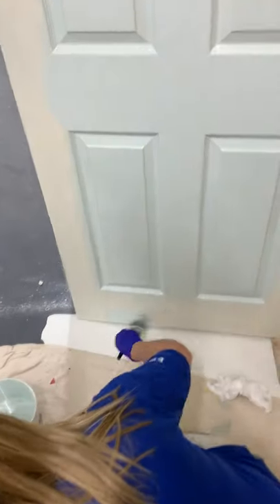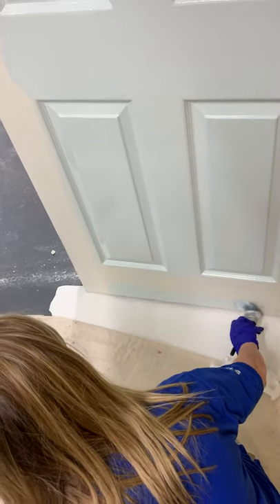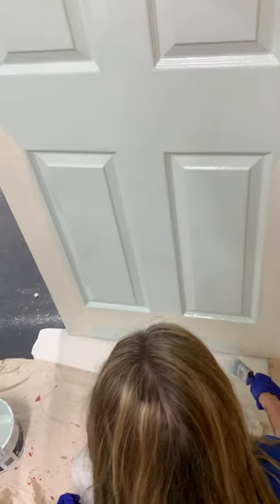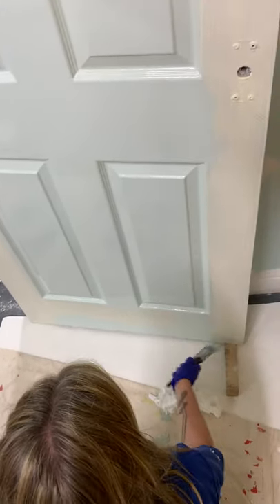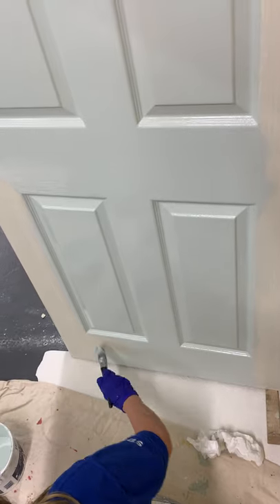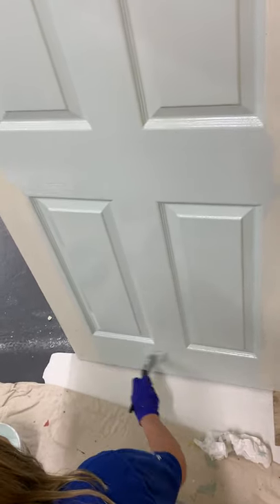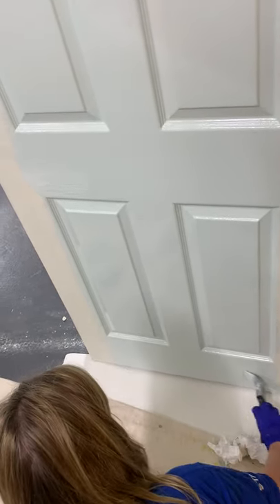You're cutting into the floor edge, but not deliberately painting on the paper — because if you do, you might tread in it and walk it around the room. Work it in to the bottom round, then really lightly lay off. What's the last bit we need to do?